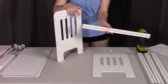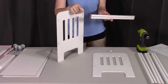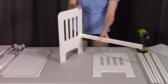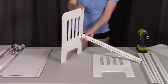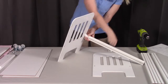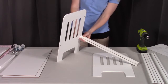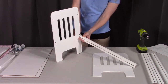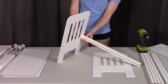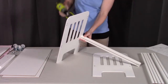Make sure that you have the groove to the inside of the bed. We're going to start by putting these in and screwing all four posts — the dowel to the top and screw to the bottom. For this instructional video I'm going to be using a drill to make it a little bit easier, but feel free to use a Phillips screwdriver as well. If you do use a drill, make sure that you have the torque setting set on low so that you don't strip any of the pieces.